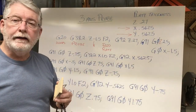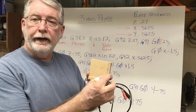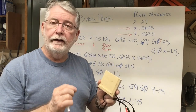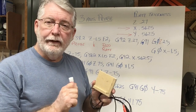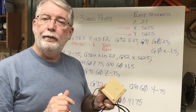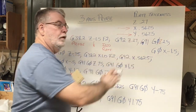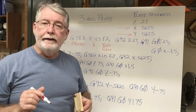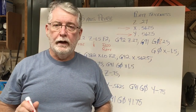When I talk about the X and the Y axis being 0.5625, there are two factors that make up that number. One is the thickness of the touch plate — in this case 0.5 of an inch. The other thing you have to consider on both the X and Y axis is the thickness of the bit you're using, and you want to take half of that thickness because when you're probing you're actually probing based on the center of the bit. So if I take an eighth-inch bit and want the radius, I divide by two: 0.125 divided by 2 gives a radius of 0.0625. I add that together with my half inch and that's where the number 0.5625 comes from. That's important to note — if you're using a different size bit, this will need to change accordingly.